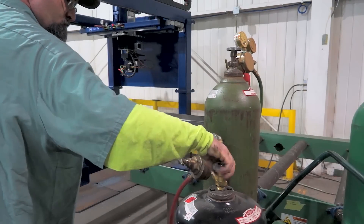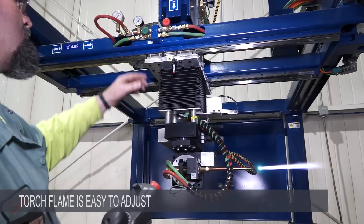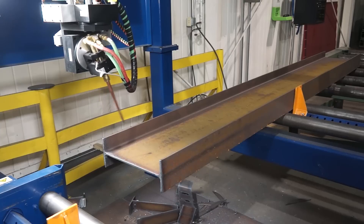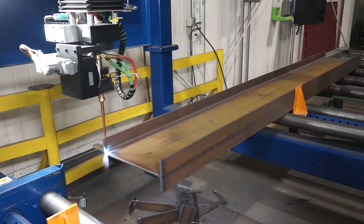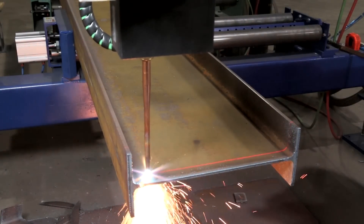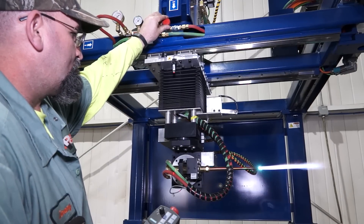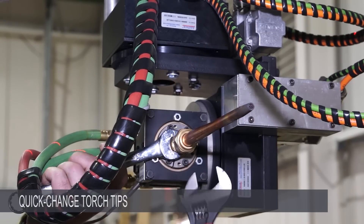Each day before starting out, the operator sets the fuel and oxygen flow rates on their respective regulators. The torch flame is adjusted at the torch head with standard gas control valves. Operators familiar with flame cutting will quickly achieve the required flame cutting jet stream. Flame cutting requires a careful balance of fuel, cutting oxygen flow, pre-heat flame, and cutting speed. These in turn depend on the design and quality of the cutting tips and your choice of fuel gas. Human experience and judgment will always be needed. For most coping and cutting, small adjustments in flow rate will suffice. For really large jumps in material thickness, the torch tip must be changed. Torch tip changes are simple and fast.